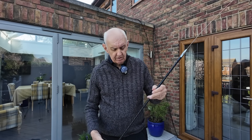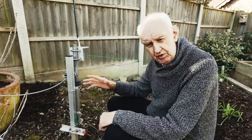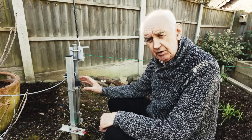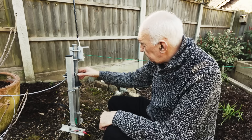This particular antenna is designed for 20 metres. If you've been watching my videos recently, I've been experimenting with the Ampro aerial as a base vertical — I think I called it a pop-up vertical. It's a vertical you put in your garden, mounted fairly close to the ground, say about a metre or half a metre, with one radial on it. The radial is directional in the direction of the radial. These antennas are about 2.25 metres high, so the 20-metre antenna is half the size of a full-size vertical, so it's fairly efficient.